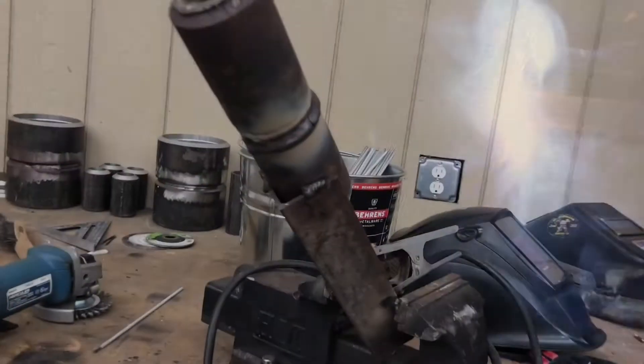Then you just keep it right at the edge of that straight line that you left — the edge of the bevel that you can still see — and just keep it as straight as possible, going from the bottom all the way to the top. All right, so I read my first stringer. I think it's pretty straight — slag's coming off easy, that's always good.